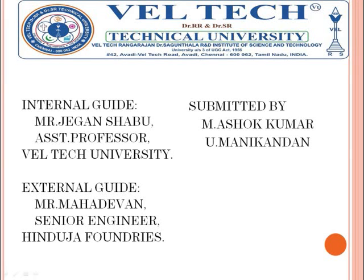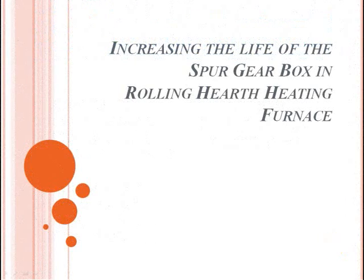Our project title is Increasing the Life of the Spur Gearbox in Rolling Hearth Heating Furnace. The whole project is about increasing the life of the spur gearbox in the reheating hearth furnace. It mainly deals with calculating the present life and efficiency of the spur gear and how to improve the life of the spur gear by changing the material of the spur gear.